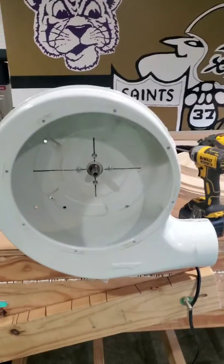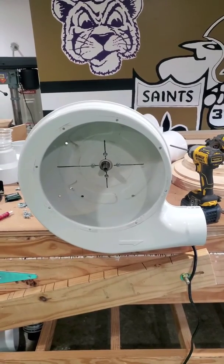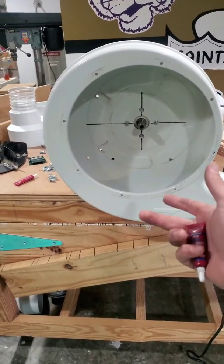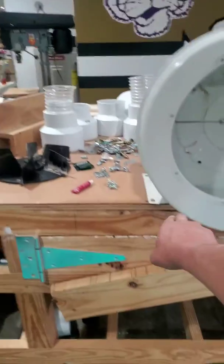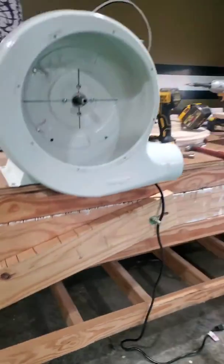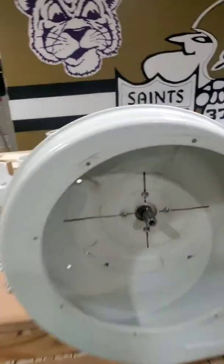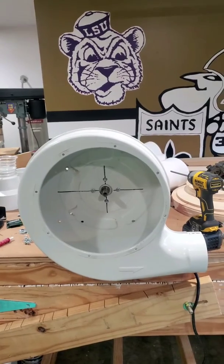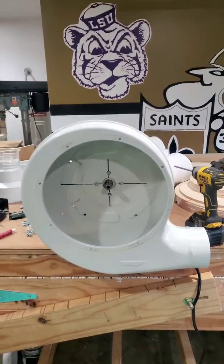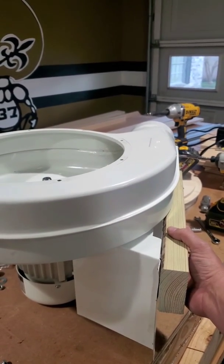We turned it roughly 90 degrees. Just note that the chute is of course more offset now. Where it was positioned before, originally the bottom was flush with that mounting plate in the back. Now you've got about almost an inch of overhang, which really shouldn't mess anything up because I'm hanging mine on a two-by-ten, so I've got an inch and a half of clearance off the wall. Here's the new offset flush on the plate — it's maybe not even an inch.